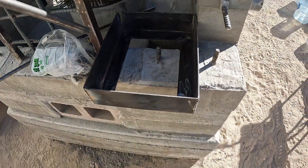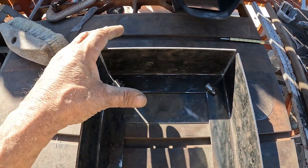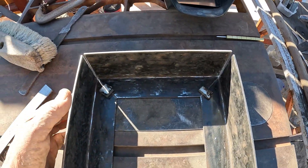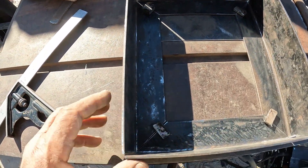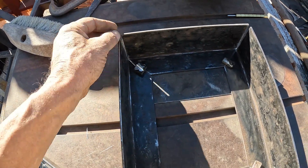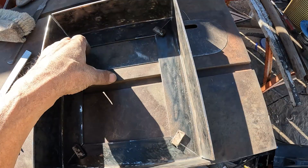I had to purchase this tubing. I like using these super magnets — they have these welder's square magnet deals, I don't have any of those, but I have a bunch of these super magnets. I did read somewhere that you don't want to get these exposed to extreme heat, so I just use them to get it tacked up and then get them out of here, because they say they'll explode. I'd be careful using super magnets and getting them super hot.